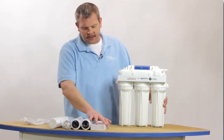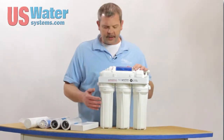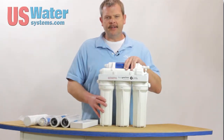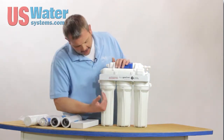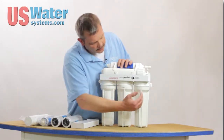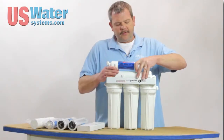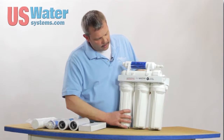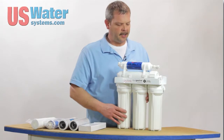All RO systems are going to have pre-filters. Some of them are what's called four stages, which would only have two actual vertical filters. Some are called five stages. It really depends on the configuration. Some people have a sediment filter, a carbon filter, then it goes through the system, comes back out, and uses the final one as some type of a post filter. We use five-stage systems and we make them all pre-filters, because depending on where you're at and what your city does with the water, depends on how much carbon filtration you may actually need.